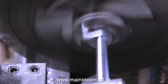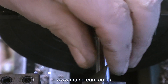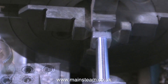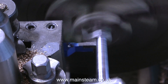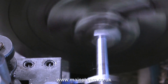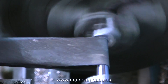I don't find this particular material very good to machine - it makes a horrible noise - but when I use some emery cloth on it, it polishes up very well and it looks fine. There's still a fair way to go yet; this part is still too thick at the bottom. The eccentric is only 3/8ths of an inch wide, so this part needs to be less than 3/8ths, and that's at the wide part. That's why it's very important to make sure that you have the correct angle set on the compound slide, because if the angle was too steep you would be removing far too much from the thin end of the part, and then that would be weak.